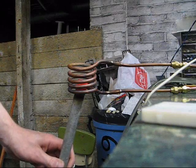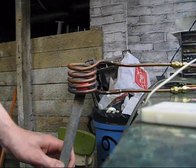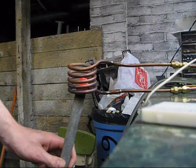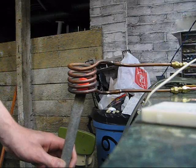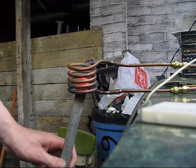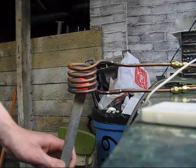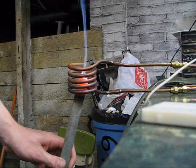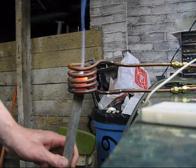Now the current's rising. As the steel stops being magnetic, I need to change the frequency. I really need a control circuit here to do this automatically. And the current rises. Now the zinc's burning — you can see that's smoking already. This is going to get stinky pretty quickly.